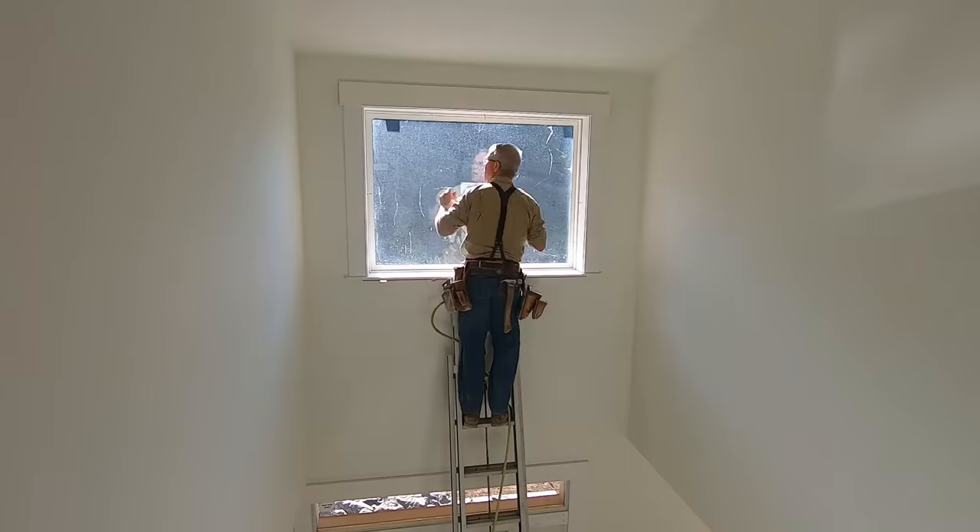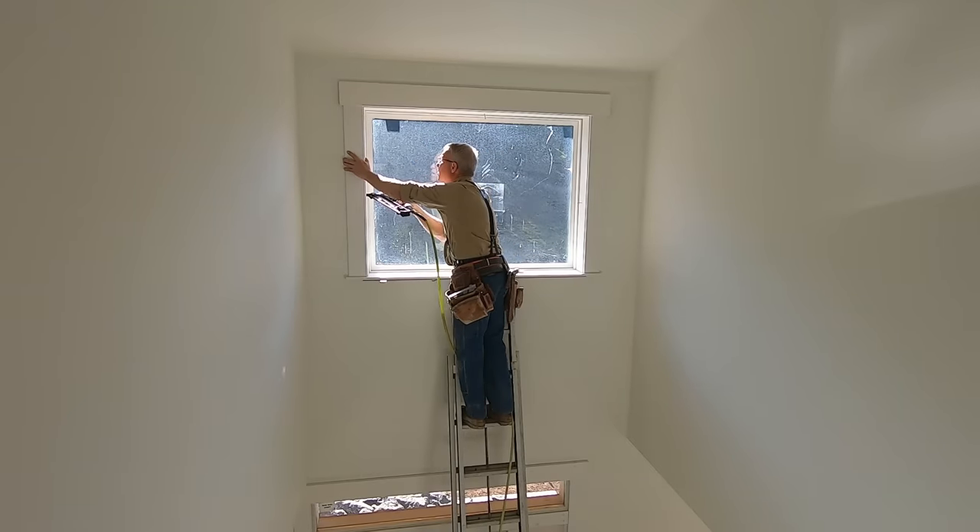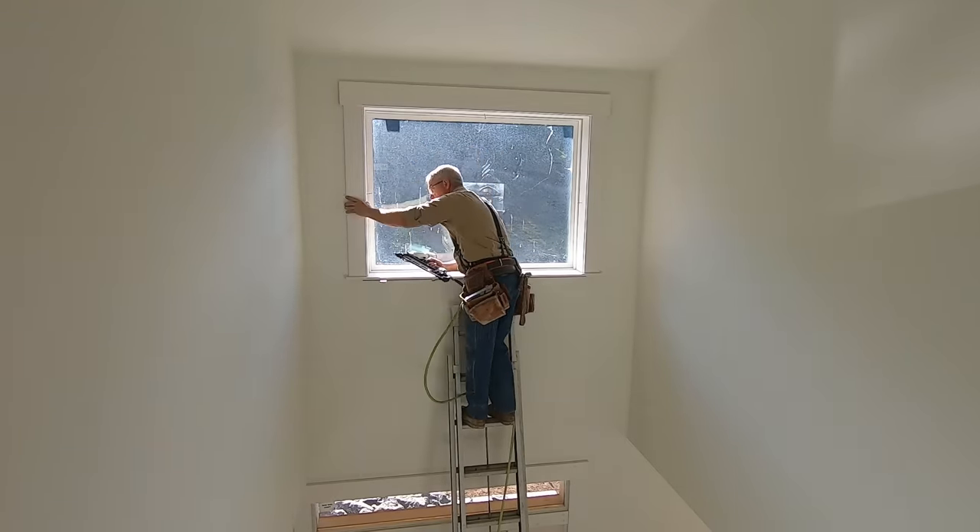This last window was the tough one. It was high up over the front door, and the only way I could get to it was off a ladder. So I changed the process up a little bit — got all the measurements, added a little distance so the reveals around the window were a little wider and more forgiving, and then nailed the whole thing together on the ground. As a kid I always loved to climb trees and build treehouses, so I sort of like working in less-than-ideal conditions like these. Those three screws stuck in the middle of the jams were so I could get a hold of them and hold them back just before nailing them in place.